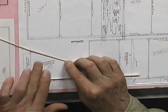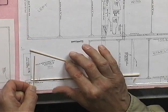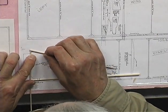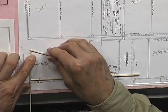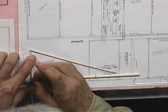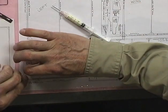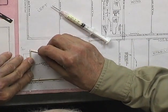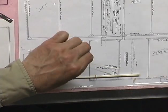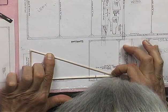Cut through. And then here's a little magic of geometry. If you take this piece and turn it like that, you've already got that shape cut that's correct on the end for those two pieces coming together there. Then all you have to do is do a straight cut up here. And I'm just going to set it here and cut that over on our square. Okay. And then we're going to do the single gluing, double gluing. Tap that one. That's going to get that wet. And a little bit more here on this end. And have to put it here to see where it goes on this end and just where they come together.